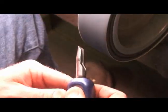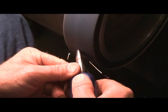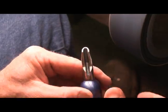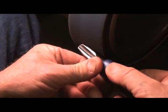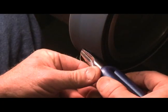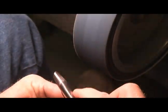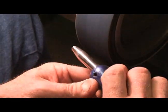The first thing to do — this is a new gouge — the first thing to do is establish a good straight line and this angle at the right angle. I've got a nice flat surface here now. I've got some good light on the subject; it's hard to do fine work unless you have good light. Now we come around and keep this bevel coming back a long way to keep the tool sharp.